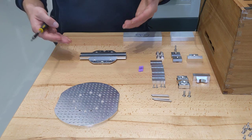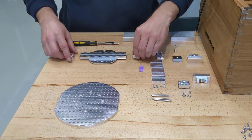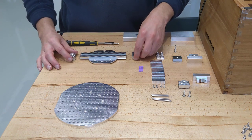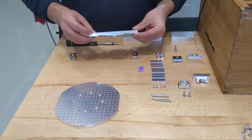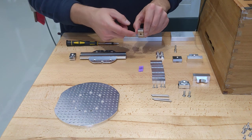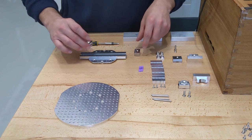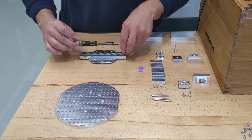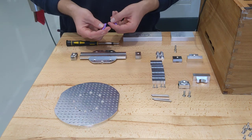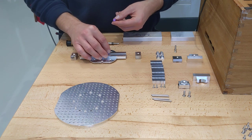The single vice version allows you to use a single vice to clamp a piece of stock. This is a clamping element, this is a locator element. The fixture plate has teeth on it, and these line up with teeth on the base of the clamp and the locator element, so you can basically move these forward and backwards to accommodate different pieces of stock. I've got two supports — they're just 3D printed pieces of plastic which slot into these grooves like so.